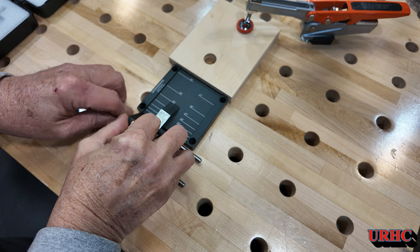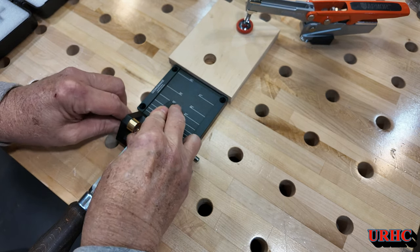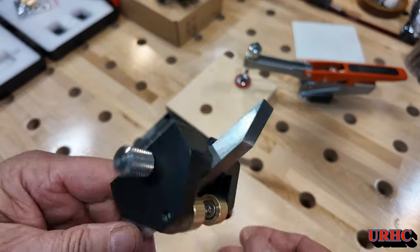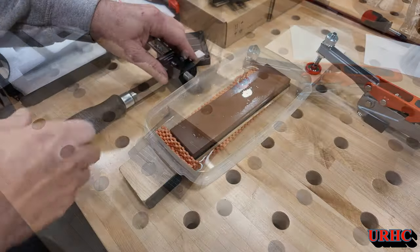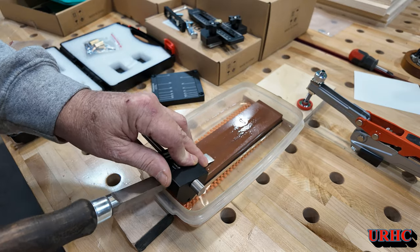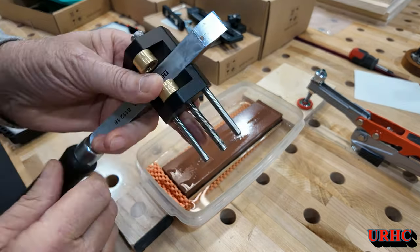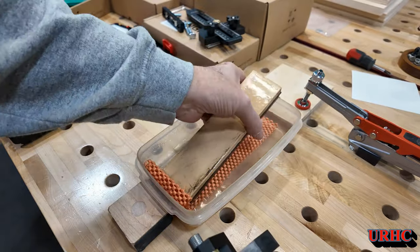What you do is push that unit up against the gauge there and set it at the angle that you want. Each one is indexed there, and you can index it up against the left-hand side to make sure it's square — I found out it came out square anyway. Then you tighten up the little thumb screw there, making sure you're holding the chisel flat down. That looks really, really close to perfect. I know this chisel was a little bit out of square, so I'm just going to grab my white stone — this is the coarse side — and do a couple passes.